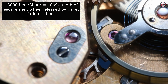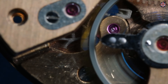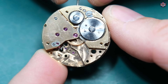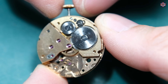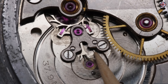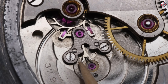The speed with which the escapement releases one tooth at a time is precisely equal to the number of beats of the watch. The hourly beats are also the number of ticks the watch makes in an hour — the speed with which the balance wheel moves right and left. Without a pallet fork, if I were to wind the watch, the force transferred to the spring is immediately discharged through the wheel train, spinning wildly and uncontrolled. With the pallet fork installed, it acts as a controller, passing one tooth at a time and transforming the continuous rotary motion into an intermittent motion.